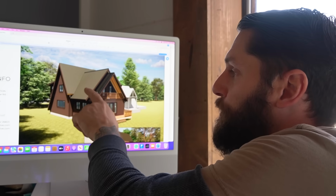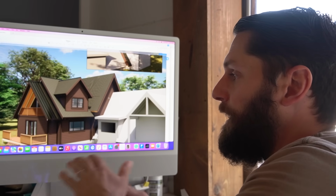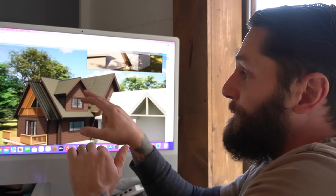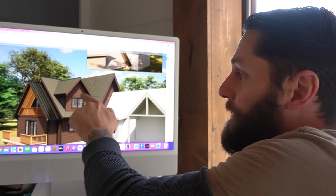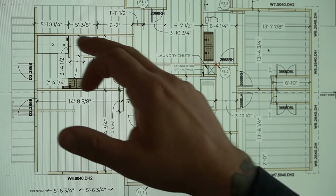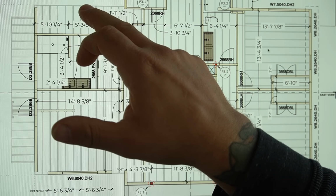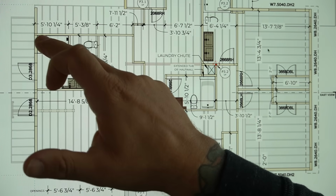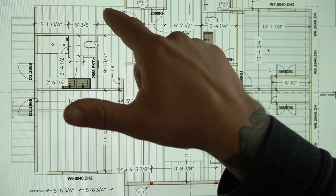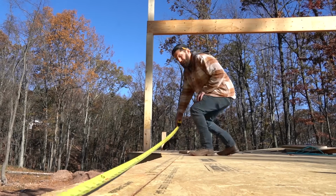Ultimately, this back portion is gonna look fairly close to this front portion right here, except for the windows. You guys know all the windows we have down low don't match this rendering right here. The windows up top, we're gonna have triangle windows, bigger windows down here. We're gonna change it up a little bit to give it a lot more sunlight. It's gonna brighten the bathroom up a lot more right here. What we're gonna do is push this wall back to this location with the dormer. As it sits right now, there's a short wall that comes up right through here and the roof comes down and sits on this back portion right there. But us adding the dormer gives us an upright wall and hence gives us a lot more space for the bathroom. So are we in agreement?